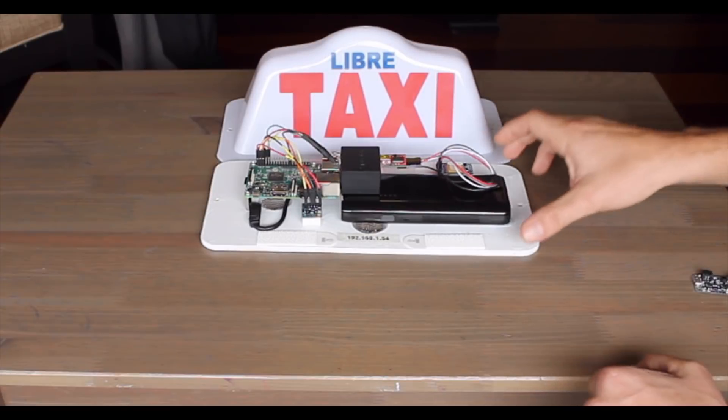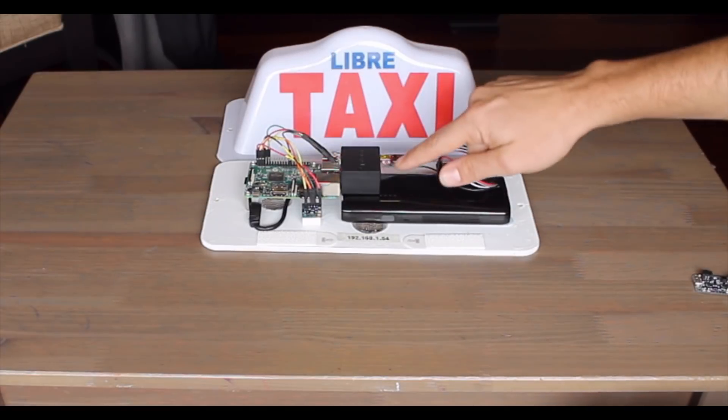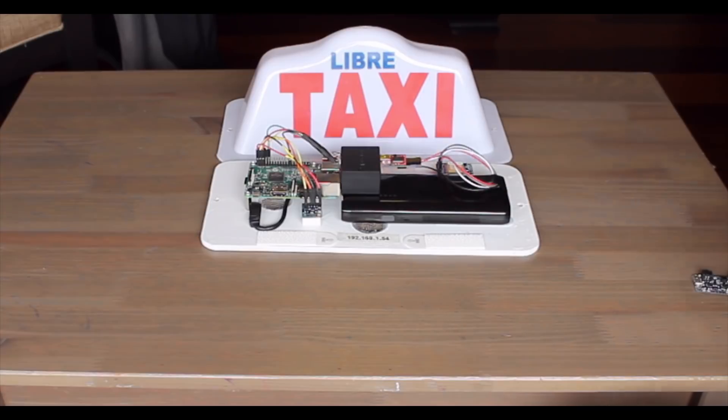You'll note that I've oriented the sensor — there's a fan on this side, and there's an intake vent here. I've oriented it perpendicular to the airflow, just because I don't think it would be to spec if I'm forcing air through the sensor in the direction of the airflow. I wanted to just sample the air as it goes by, as opposed to being directly on the flow, because otherwise I may get erroneous values.